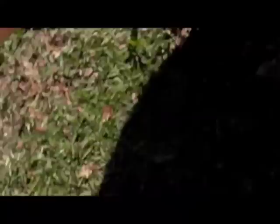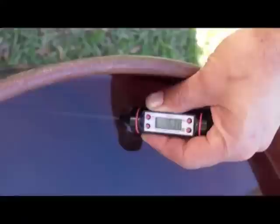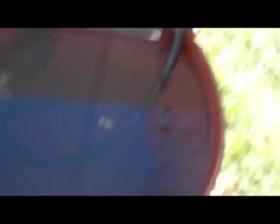So we're coming up on one hour — 50 gallons of water starting at 70 degrees. And we were able to get it to 76.5 degrees Fahrenheit. That is a 6.5-degree rise using just a simple mirror and some black water hose. Keep in mind, this is circulated very well — this is an entire 50-gallon drum of water, so that's pretty good considering it's not just surface temperature.